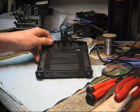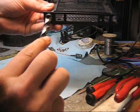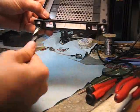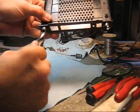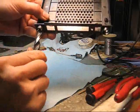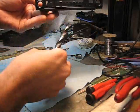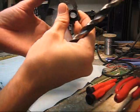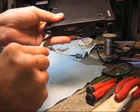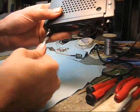For this next part I'm going to be doing the drilling and fitting of the RF connectors. The best I can come up with, like we talked about before, is the 29/64 drill bit on the index scale here. You can look down the center and it's about that size when you're looking at this hole. Basically, I'd start out with that and just do it by hand right now to get it started. The plastic sometimes is real brittle, so you don't want to try to break it. It's always a good idea to start out in case there are any burrs, which can really catch the drill bit if you use a real powerful 18-volt drill or higher.